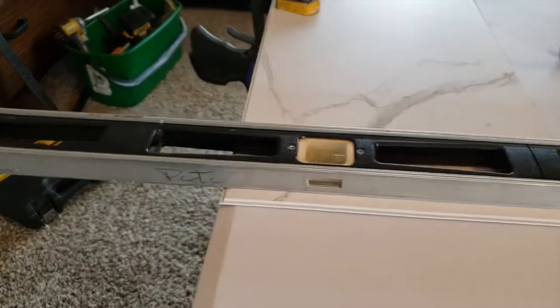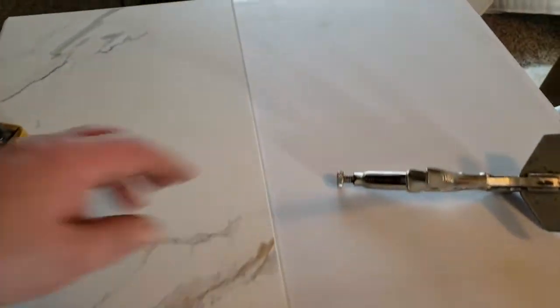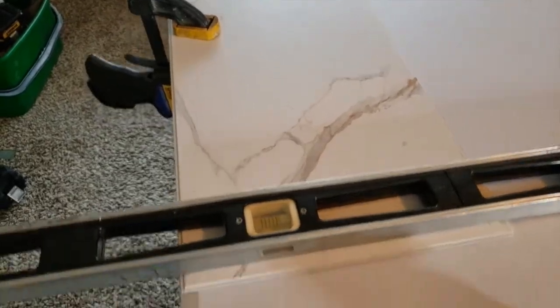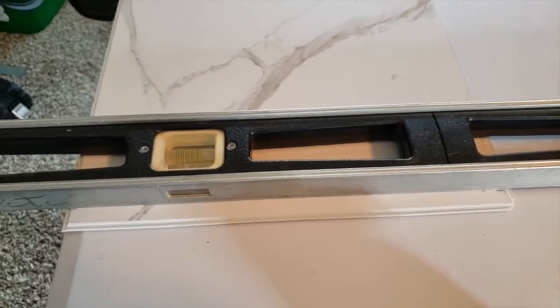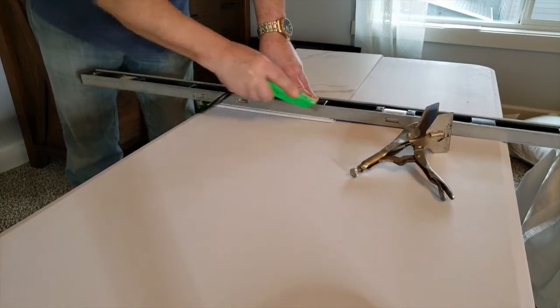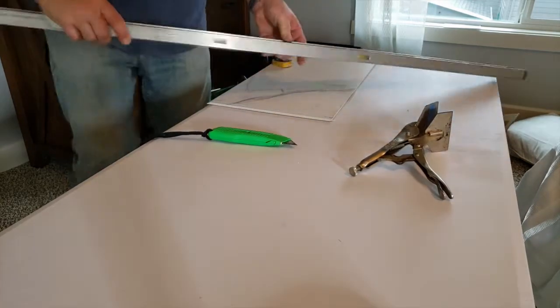So I've got a cut here. Most of these are going to be about a half inch. What's probably going to help is what we call duckbill vice grips. Got a wide grip on it. I know that's something that most of you would not have in your toolbox, but I think it's going to help cut this thing. So I'm going about 10 scores.